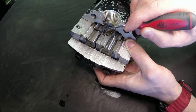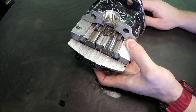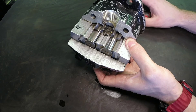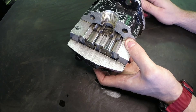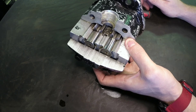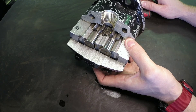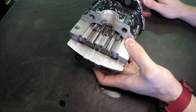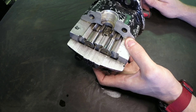Because of the seal made by the gear teeth ends to the housing and the flat sides of the gears to the pressure plate, this is also a positive displacement pump — it will produce a lower volume but very high pressure. Gear pumps are among our lowest volumetric efficiency pumps, but they are also our most tolerant pumps of contamination. You will see them used in many scavenging operations and applications involving dirty or contaminated oil, as they are likely to last the longest in those adverse conditions.